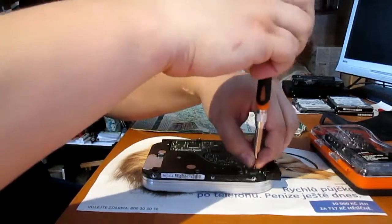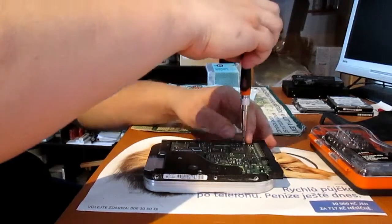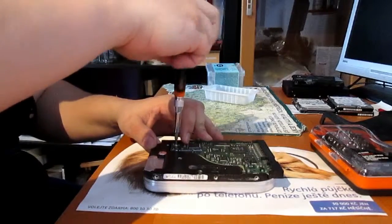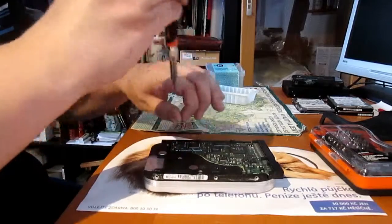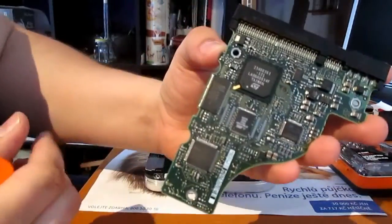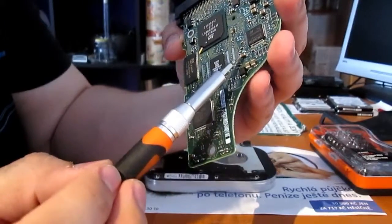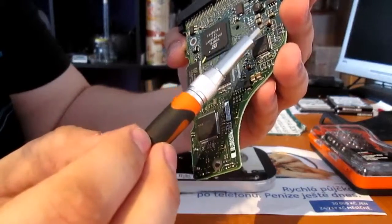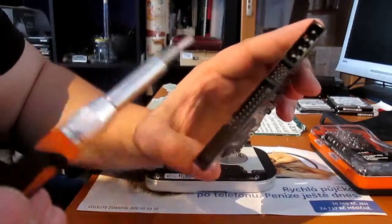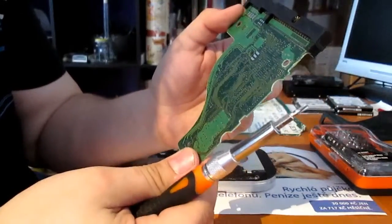This part on this side of the hard drive is a logic board. It is a high-grade motherboard and probably the most valuable thing on the entire hard drive. It contains a lot of precious metals as well as precious components such as MCCs — monolithic ceramic capacitors — that contain 10% silver and 2% palladium. Also, these pins are probably gold plated.